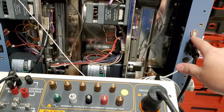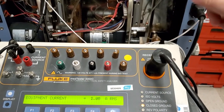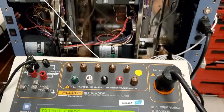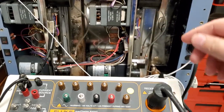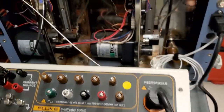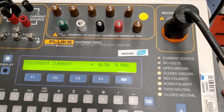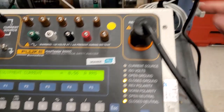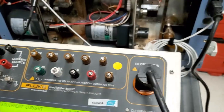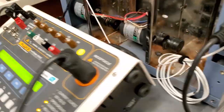This unit is set for a 15 amp breaker, and the data plate is rated for 10.5 to 11 amps. It did not trip the breaker, and yet it did have an overheat. You can see the agitators are drawing almost nothing — that's good. That means both those motors are good. We just had the motors raise up and neither one was bad.